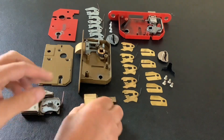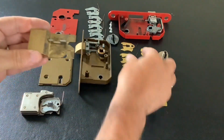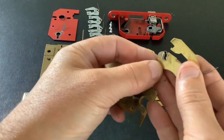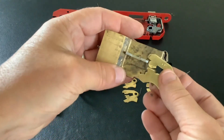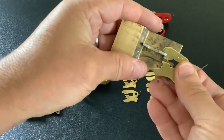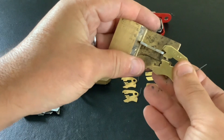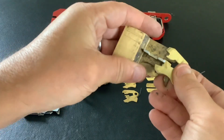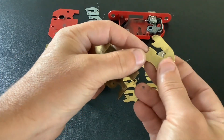This one is out of a Merchant Hardware and it's exactly the same principle. I'm going to pick this lever up because this lever has got two false gates or anti-pick notches — one at the top, one at the bottom. When you're picking this lock, the aim is to get through the true gate. If you get caught in that, it's going to lock up and you're not going to get it open. And if you manage to pick past that one but go too high, it's going to catch in the bottom one, and again you're not going to get the lock open.